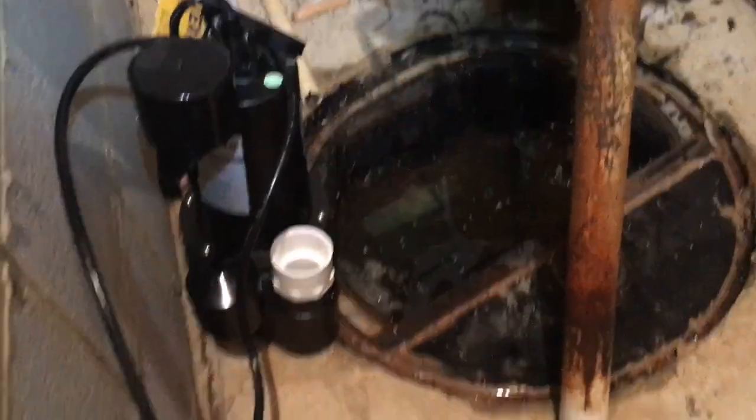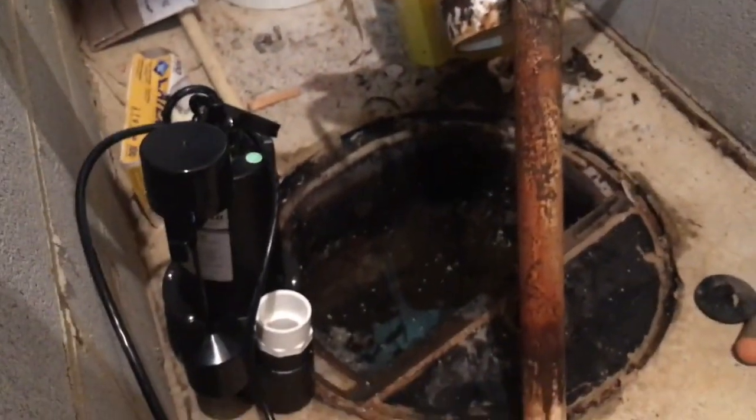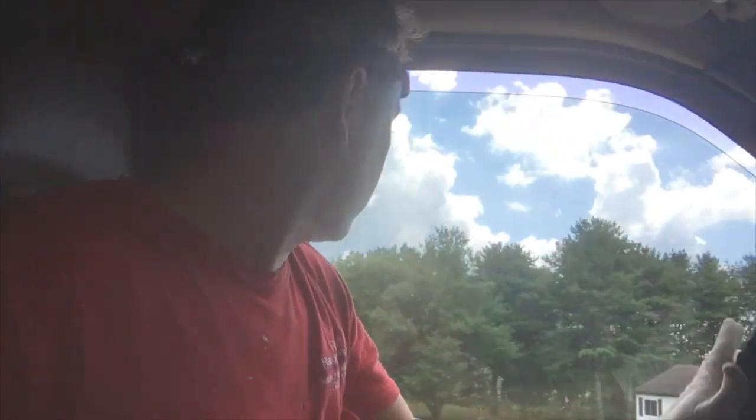We are back on the job site with a brand new pump. I'm not going to be able to film while I install it for fear of dropping my phone in the water, but I'll show you the finished product. Devil is in the details — this pipe and fitting do not match up. It's inch-and-a-quarter pipe. If you don't use it, you lose it; I don't do a lot of plumbing anymore and I should have seen this. So now I've got to go back to the store and get the fittings to make this work. I would love to edit my troubles out, but this is real.